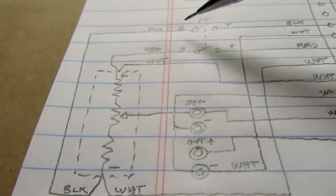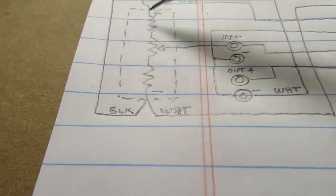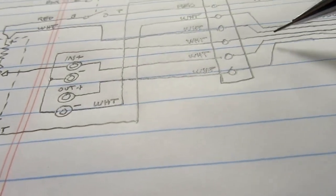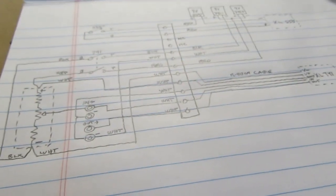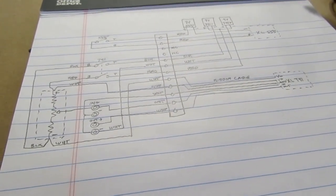And meanwhile, the positive and negative switched sides, besides running back to the 741, also power the potentiometer on its plus and minus sides, and the wiper daisy chains over to the input positive pin jack before continuing to the header and onto the input of the 741. And the output of the 741 comes back, goes through the last pin on the header, and goes to the output pin jack. So, again, exactly what I expected to see. I just wanted to refresh my memory and make sure that it was all accurate. Now I have to see how that's going to work out for the new circuit. Make sure I'm not short any pins that I'll need.